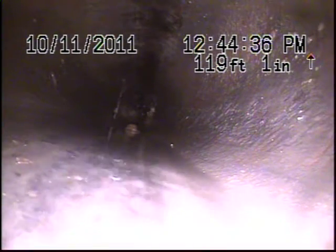In order to do maintenance on this line, it requires a clean out installation, a 6 or 8 inch clean out, to be installed, so they could actually hydrojet this line and try to remove all these roots growing through the joints. Pretty much every joint connection has roots, but this one here is the most severe.